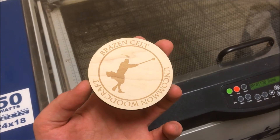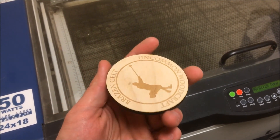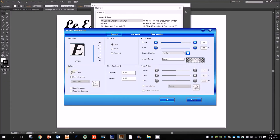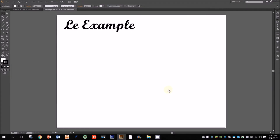This should cover the vast majority of the jobs you'll run on the laser. However, there are some other things you should know that will help you out for those special circumstances. One thing you should know how to do is to manually focus the laser. In the Epilogue printer preferences window you'll usually check the box auto focus, which causes the laser head to automatically adjust the height of the table for the optimal focal point for cutting or engraving. This option works well when your piece of material is a uniform thickness or when you can position your artwork in the specific place you want to machine on the sheet. However, for some projects manually focusing the laser is preferred. In these cases you would not check the auto focus box during printer setup and you would need to manually focus the laser before pressing go on your file.